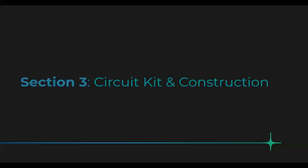So now let's talk about how to measure the voltage, current, and resistance in circuits. Okay, so you can see your dial over there. Let's go to the top left corner. You will have the V side, V for voltage, and then you will have a solid line and three dotted lines for signal. That means that it's DC voltage. That's for most of our applications here. On the top right, you'll see V with the wavy line, that's AC voltage, that's for your outlet. We don't need that right now, so DC voltage here.